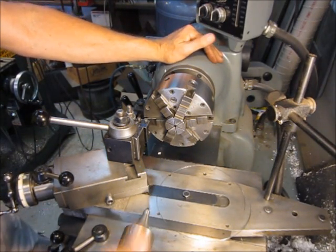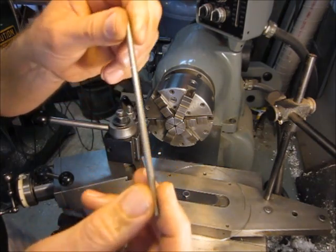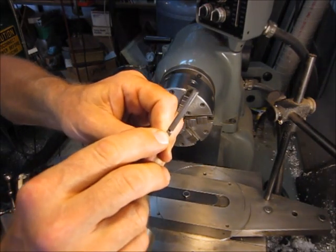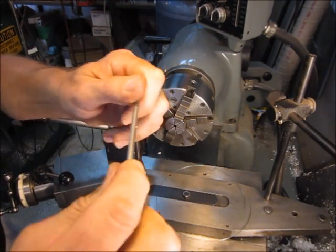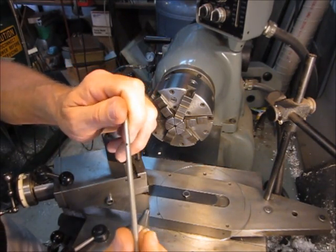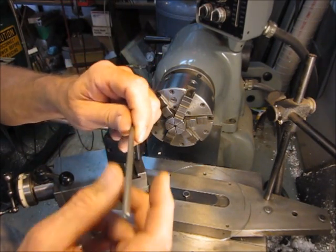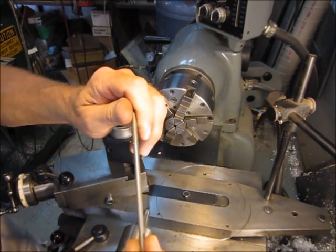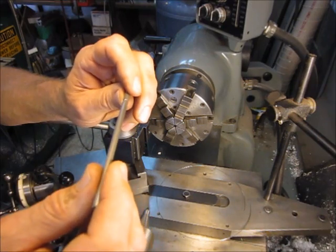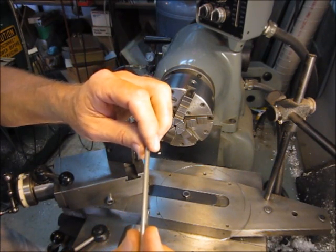Let's talk about tools. What kind of tools do you need to wind a spring? First thing you need is a mandrel to wind the spring on. This one in particular is a piece of cold rolled steel, ground, with a center drill on one end to support it, and a cross hole drilled near the other end that I can put the wire through to help it start winding. You have to select the size of the mandrel based on what size spring you need. The mandrel has to be a little bit smaller than the ID of the spring, because when you wind a spring on the mandrel, it winds a little bit large. It's basically a trial and error thing. I have a bunch of different sized mandrels on hand to suit whatever spring I need.